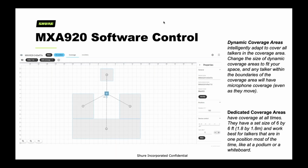The only thing is that what we're adding now, we're telling the system, instead of automatically creating 8 lobes, because not a lot of people use 8 lobes. Some people only use 4 or 5 or 6, depending on the room size and the coverage that they want for that room. Now we didn't take it away. We basically automated it to tell the system, this is the area that we want you to focus on and look at. But you still have up to 8 lobes available. Rather than me saying, focus always 6 lobes on this, we're saying you have up to 8, and you could create them as you see fit. So essentially the system becomes a little bit more flexible because you're not limiting where the lobes can be.